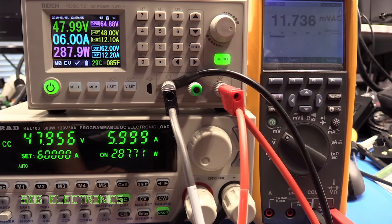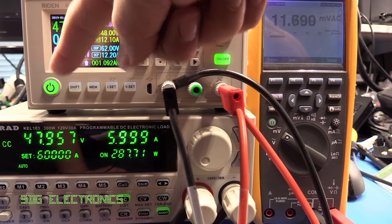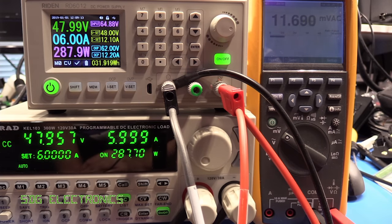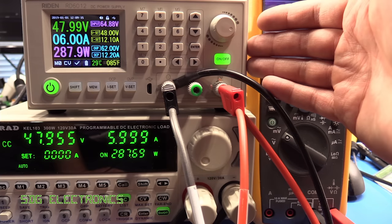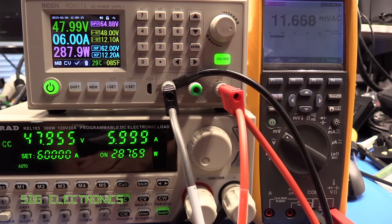So I might have a little bit of an investigation. The main problem is that when you've got this turned on but turned off with the soft power on at the front, the other one still has the fan running the whole time. This is the newer version, so if you were to buy one of these, this is what you're going to get. They obviously decided that the 70 volt power supply wasn't up to the job, as well as having that problem with the inductors squealing slightly.